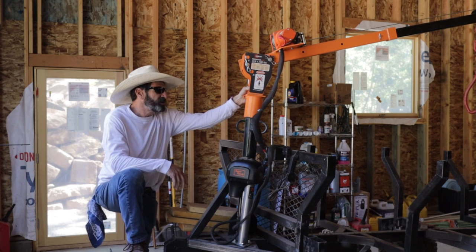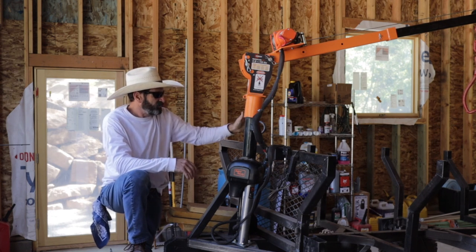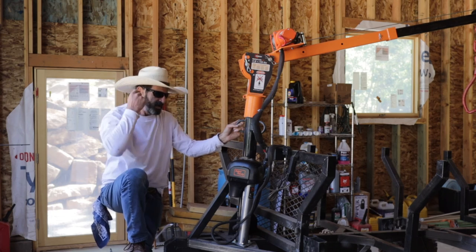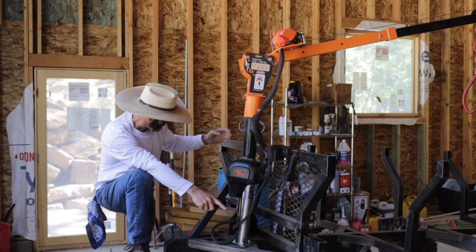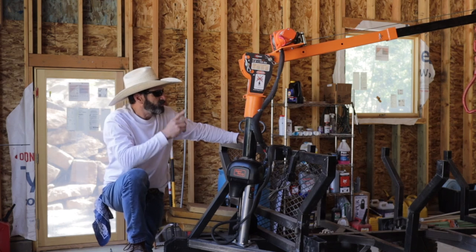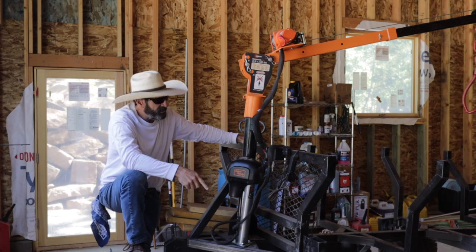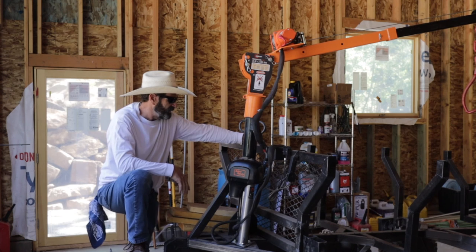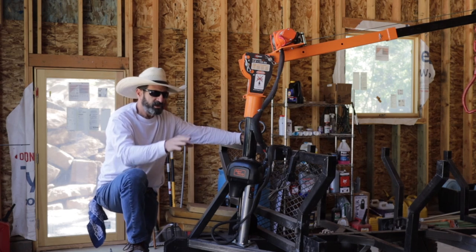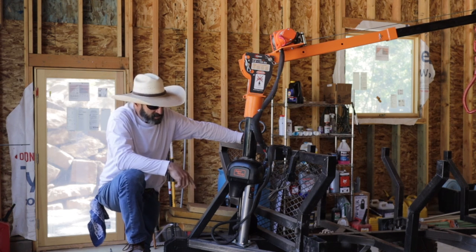I've lifted some pretty heavy logs with this and I welded these rings on it so that if I need to drag a tree from 50 feet away, I hook up these two stabilizers and stretch the cable out with the grappler to pull those logs in. If you didn't put the stabilizers on, it would twist the whole lightweight trailer. So I use the stabilizers both when dragging and when lifting.